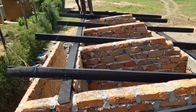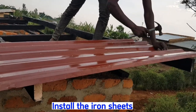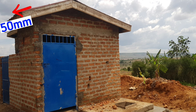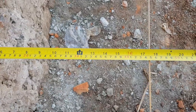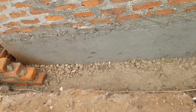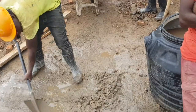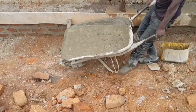I made a full video on how to treat timber against termites on site — be sure to check it out on the channel page. After fixing the purlins, fix the iron sheets, and lastly fix the fascia boards, leaving at least 2 inches or 50 millimeters from the fascia board to the extreme edge of the sheet. We intend to build a splash apron 300 millimeters away from the main structure, so we excavate down 200 millimeters and compact properly with a jumper. In case you are building in loose soils and you don't compact, whatever you put on top will crack and eventually break away.